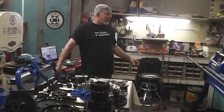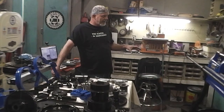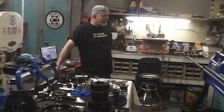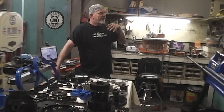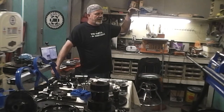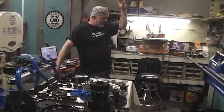I had contemplated putting the secondary drive and the motor down on the bottom underneath, but because of the metal shavings and everything else, if I do that, then I'll have to build a cabinet around that. So I'm not 100% sure what I'm going to do with that. I know I don't want it leaning way out the back, because I don't want to have to pull this thing that far out away from the wall. And I'm not so sure that I want to have something that's 7 feet tall in here and have the weight of that 5 horsepower motor and everything else up there.